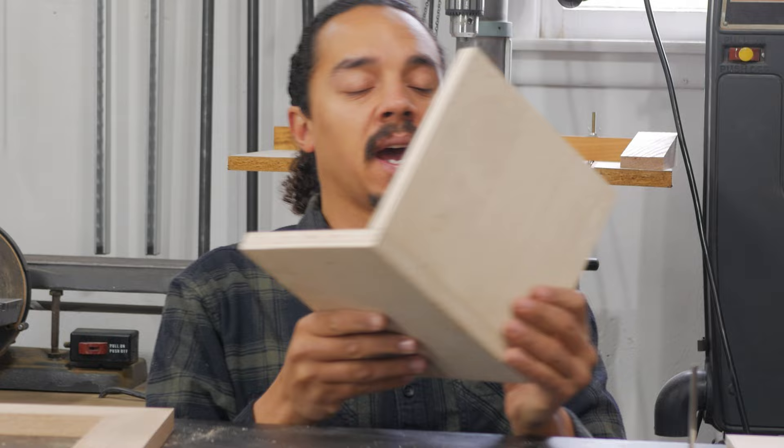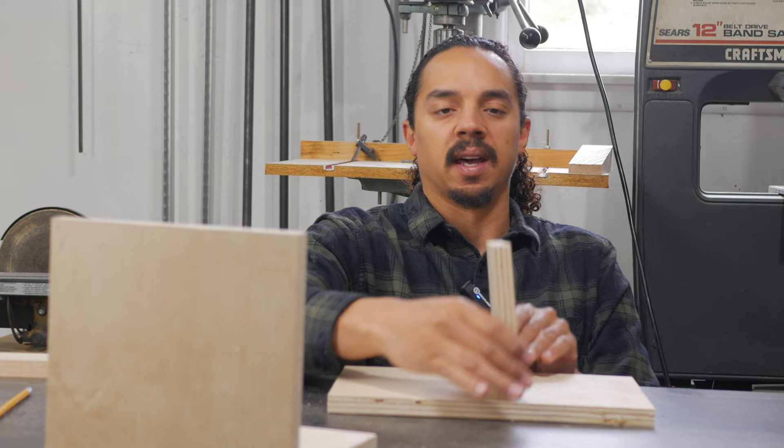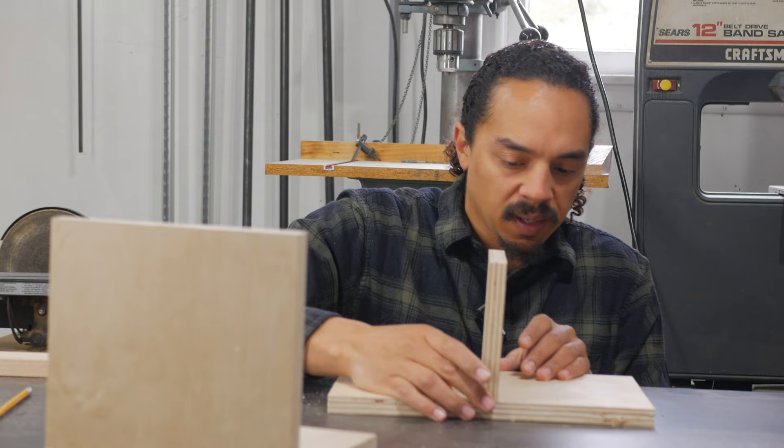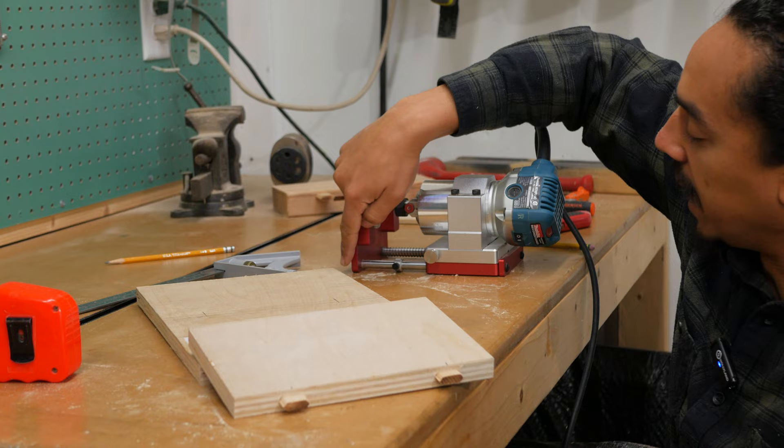If you ever wanted to do a really strong butt joint without any screws — done. Now we move on to this one. You're making a cabinet and it's got a middle divider. You want to go smack down in the middle — another butt joint. This one is a little tricky because of the way the fence is on the jig, but I'll show you how to do it. Super easy: all we're doing is using our original piece to offset the length of this red fence right here.